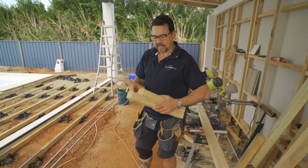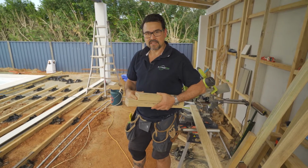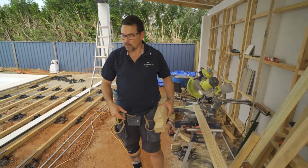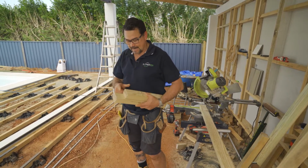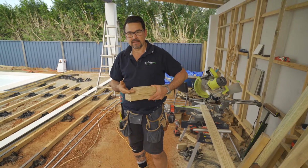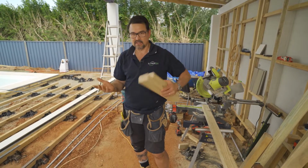If you were having to check this out of a 90mm post, you would most likely be using hardwood to start with, so that's then going to have an issue with your blade over time. I'm also wanting to keep my blade in good condition so I can cut decking board with it, and you'd have to do multiple cuts through here to then have to chisel out or plane or sand or whatever it is. So for me, this is just easier.